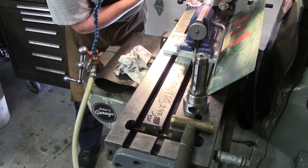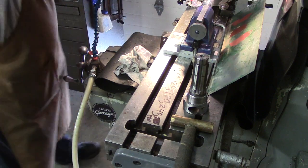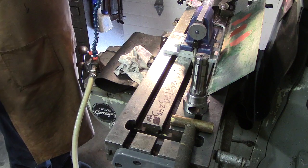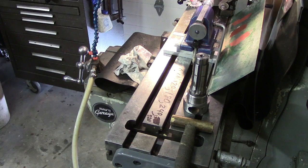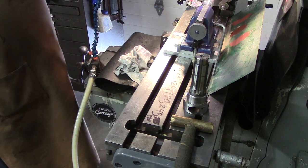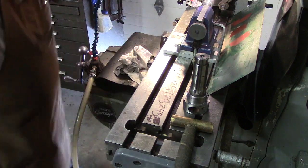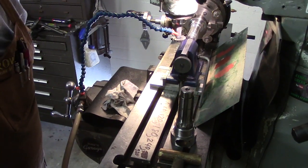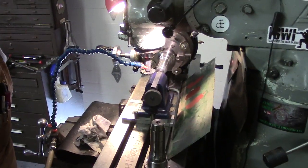Over here it's 60 - we'll lock in. We are running at 80 RPM - low, low, low. Let's turn on our rotary phase converter. I'm in back gear. I have my gear turned around because you always want to cut heading into what you're doing. Let me lock everything down and get you guys zoomed in here so you can see what's going on.